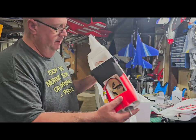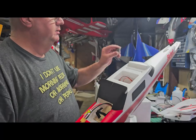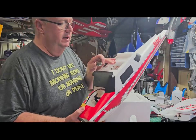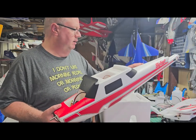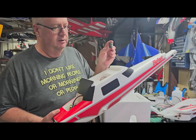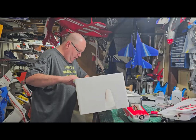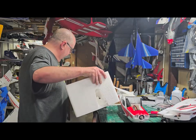The Vector system is already installed. This is one of the reasons I'm saying use an AR620 or the Lemon RX Gen 2 seven-channel — you've already paid for the Vector system, which is the control board and stabilization of the aircraft. It has all the different levels, and you don't want one gyro fighting with another gyro. That's why you use a non-gyro receiver like the AR620.